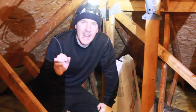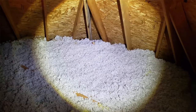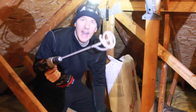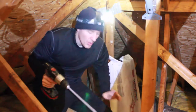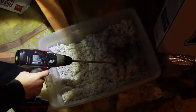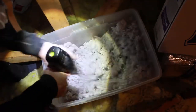It's been a couple weeks and I've learned a few more things about the insulation. I'm happy with how that area turned out in the end, but I think I could have done better at fluffing it up more and providing more R-value. So here's what I'm going to change: I have a drill with a mixer pad — I use this for mixing grout — and I have a large plastic tote. Instead of just spreading it and fluffing it with the rake, I'm going to mix it in this tote first, fluff it up, and then spread it, hopefully getting it fluffier and providing more insulation value.